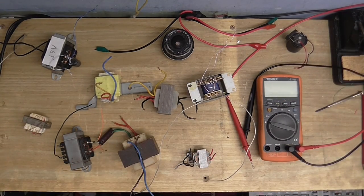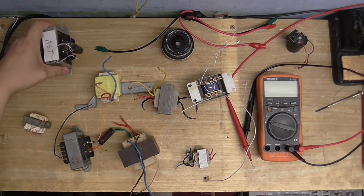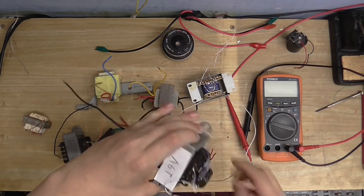That's also going to be run ballasted, and although I run my vacuum tube Tesla coils without a ballast for the most part, solid state's going to blow up on you if you're not too careful, whereas the valve stuff is a bit more forgiving. So, anyway, this was my first idea of a power supply for the control circuit.